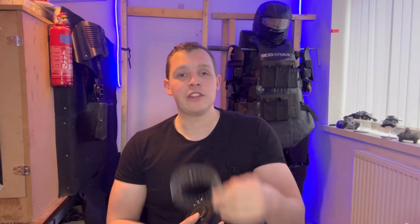I decided to make two different types of stator. One is an SMC stator - soft magnetic composite - which is typically iron powder mixed with silicon and bound together with a resin, typically epoxy. I also ended up using a regular silicon steel stator, built up from many sheets of silicon steel cut to shape. My stator design isn't perfect by any means - that's something I'll be refining - but I needed to work out how to build these with so little tooling.